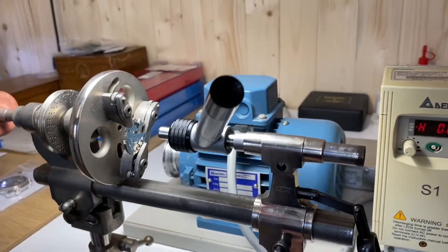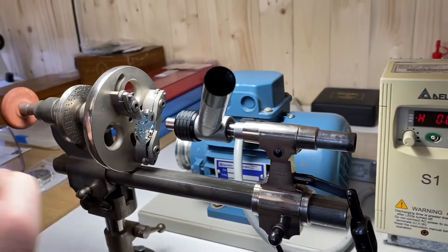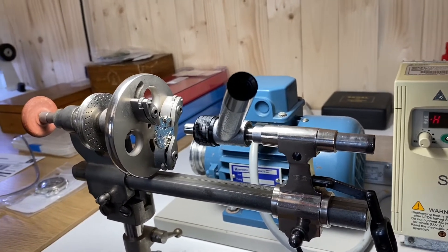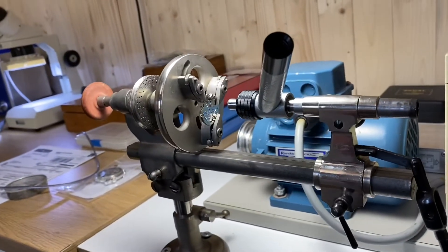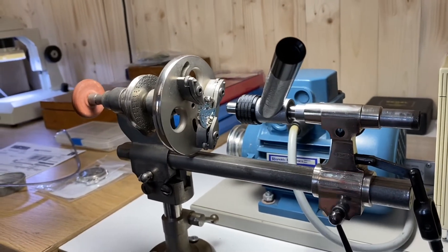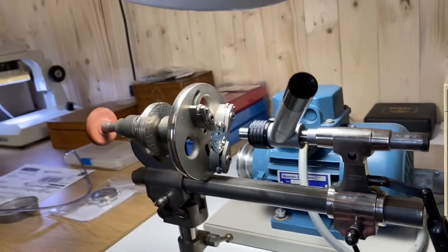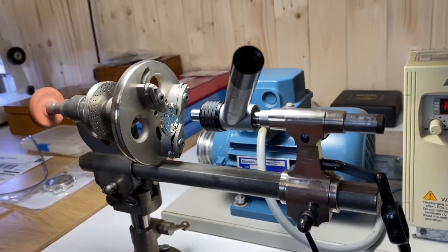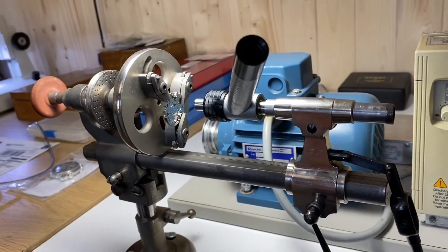A drill bit is not the most precise way to cut a hole. The most precise way to drill a hole is with a boring bar — first you use your drill bit, then you use a boring bar to bore out, and then you have a perfectly precise hole. I don't use drill bits generally for these Seikos — I use the cutter from the Seitz jeweling tool. This small discrepancy from using a cutter like that or using a drill bit doesn't have a bearing on the uprightness of the barrel in these Seikos.